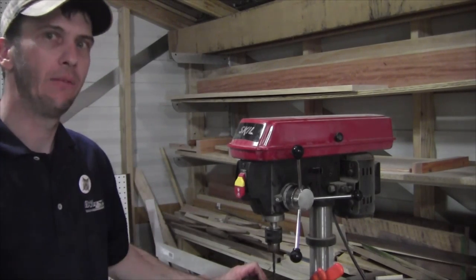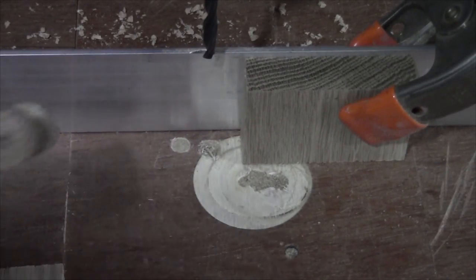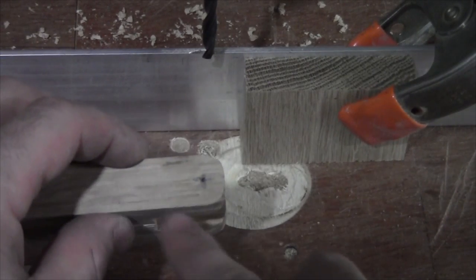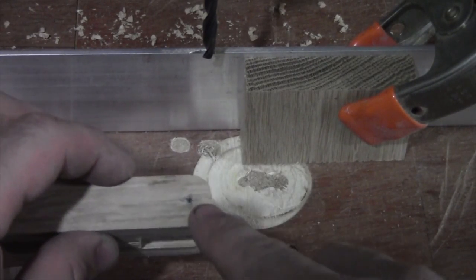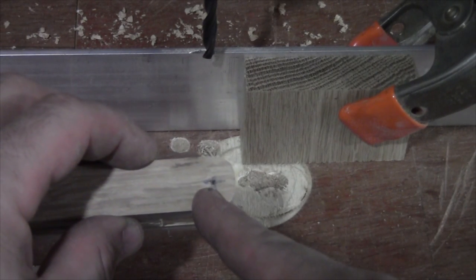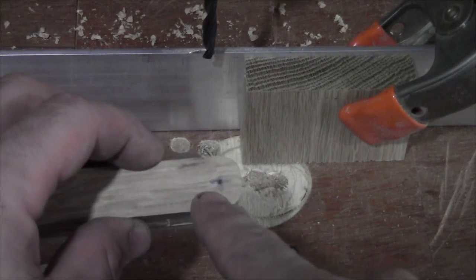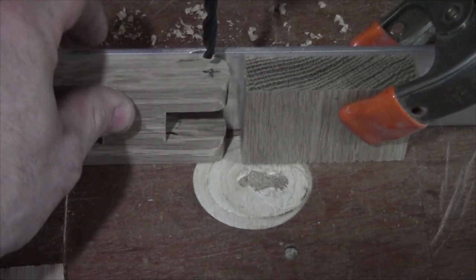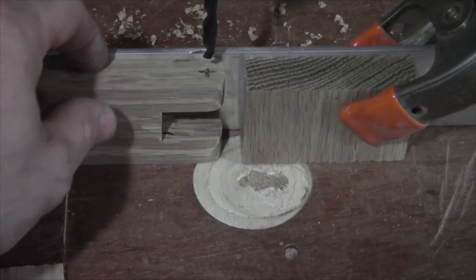Let me show you what I've done for spacing. The first thing I did was set up my mark for drilling. My mark is in the center at 3/8 of an inch, and then from the edge at 5/16 of an inch in. That's going to be my drill mark. And the first thing I did was set the fence up and the drill bit for that.